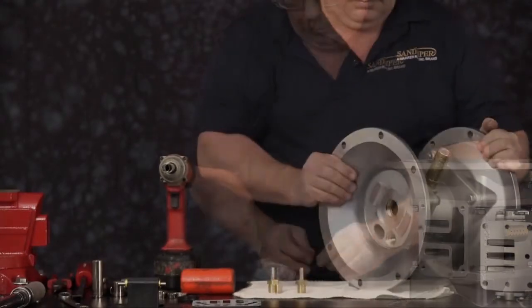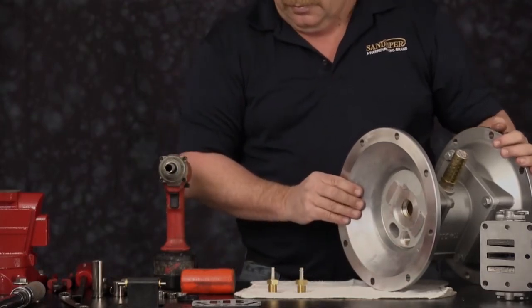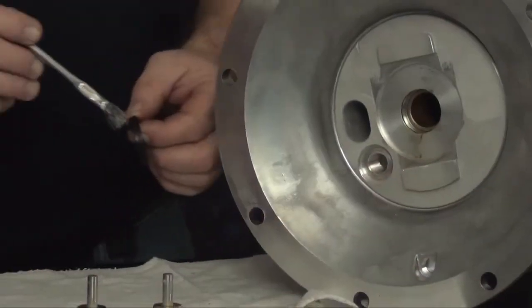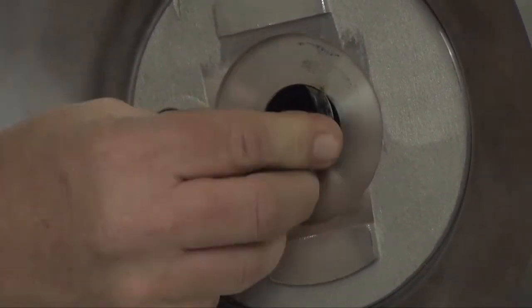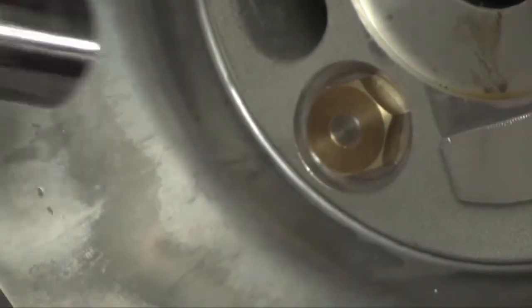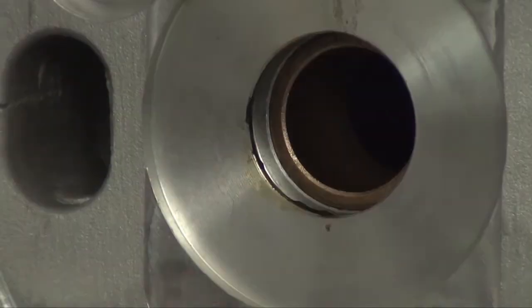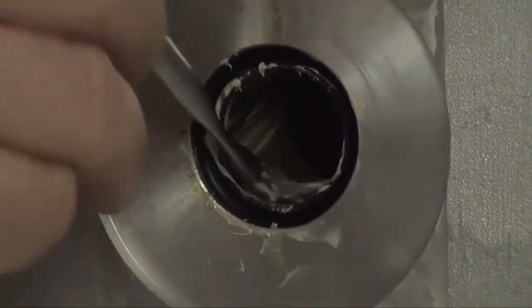Check the inner chambers for any sharp edges that may have occurred during wear and tear of your unit. Use crocus cloth or emery paper to dress up any radiuses. Inspect the diaphragm rod bushing for wear. We are now going to install the U-cup seals with the lip of the seal pointing towards the diaphragm. Lightly grease the U-cup seal and bearing. Note that while any lubricant can be used, hydrocarbon should never be used when installing EPDM parts.